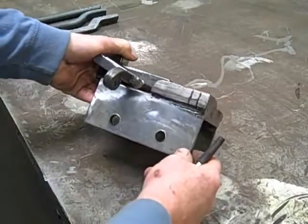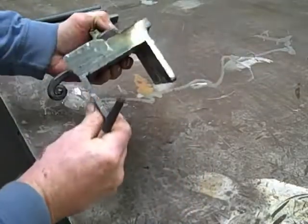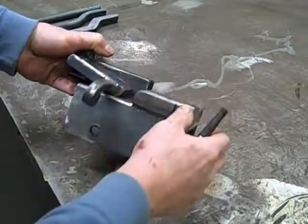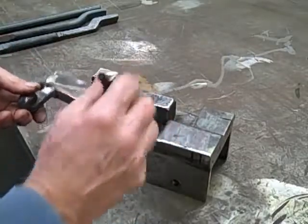Bottom die of my Max 60 hammer. The measurement of the lower die is 3 inches by 6 inches, and as you can see, this simply fits down over and bolts through holes in the die. Explaining this a little bit, this top piece is simply a kiss block.